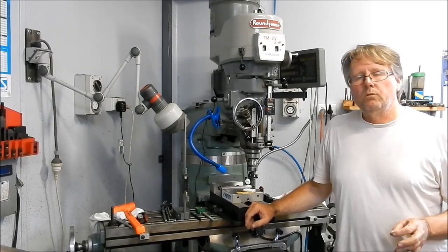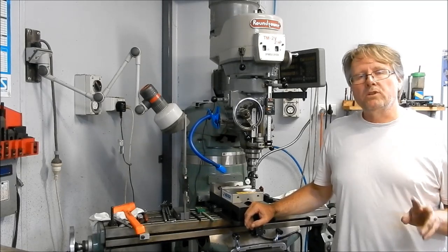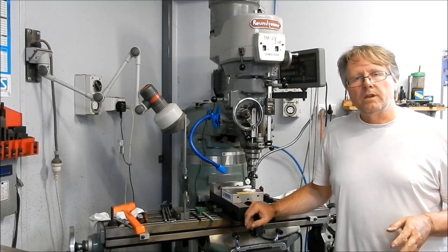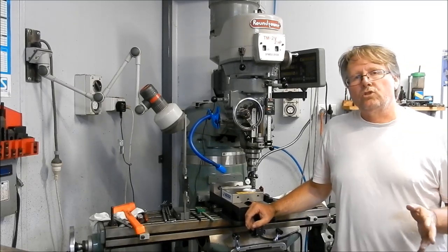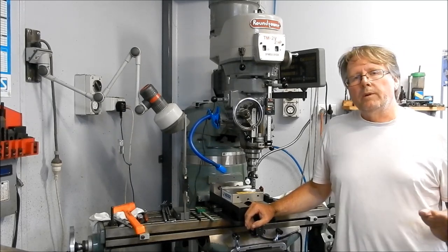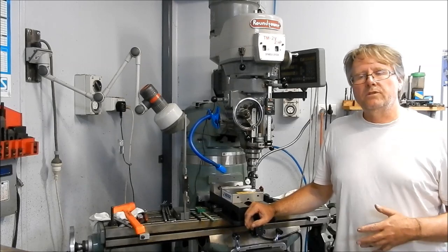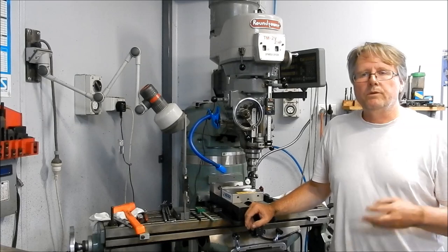Talking about mullers — when we were running the foundry we had four mullers. We had two small batch mullers, one for green sand and one for petrobond sand, or K-Bond sand as we called it. That was our recipe developed at a university in America — it mimics petrobond but is an awful lot cheaper, and it's something you can continually rejuvenate. The bigger mullers included a large roller muller and a large paddle muller used for the cast iron sand, which had coal dust in it.